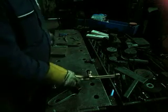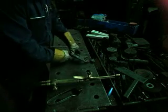Well, that was fast. Notice the heavier slag — a little harder to get off, but it will come off. Still a decent cut, but that travel was a little bit fast to get good slag removed.